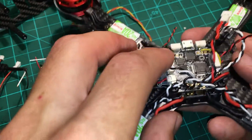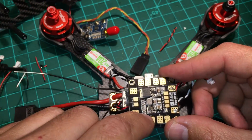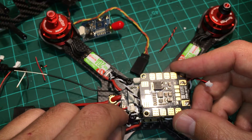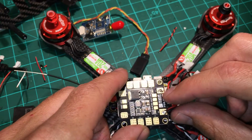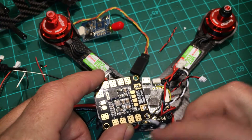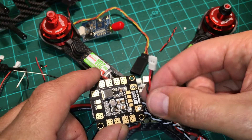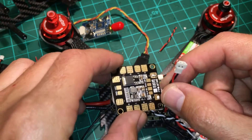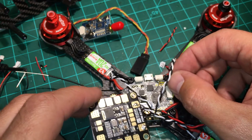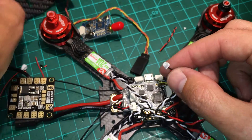The flight controller that comes with the kit — this connector here is for the voltage input to the flight controller, just running down to these pads. On the 5-volt side, I have wires running to the 5-volt rail where your inputs are. Off the flight controller I also have a connection for my lap timing — iLaps or TrackMate — and a 12-volt connector to feed my FPV system.